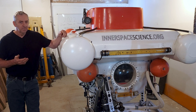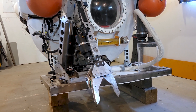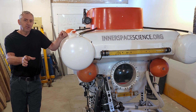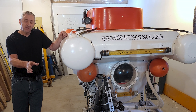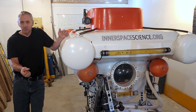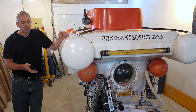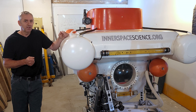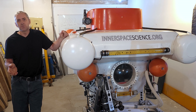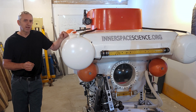The next thing that can get tangled, especially, is the mechanical arm. It's kind of just hanging out there and it's quite vulnerable to get hooked on things. I could actually reach out and grab a big piece of gold, and all of a sudden I've got a hold of something and the arm quits — now I'm literally locked onto something on the bottom of the lake. So the whole arm can actually be jettisoned right off the sub. All I do is turn a lever inside the sub and rotate it a few times because it's a threaded fixture, and the whole arm falls right off. All the electrical lines and the air supply line to the arm all just automatically disconnect.